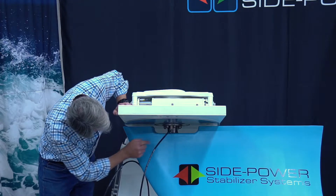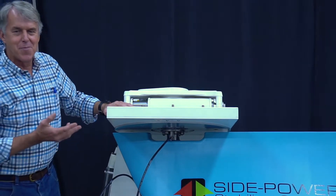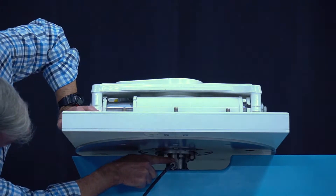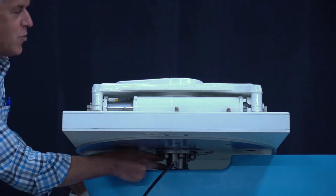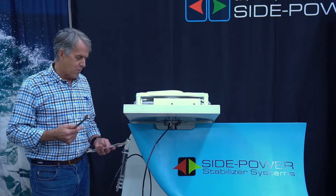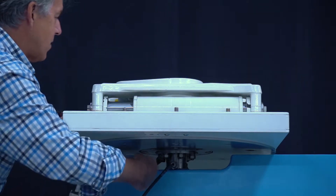If you can see these, there are about a dozen nuts threaded onto studs which are embedded in the actuator. I've taken some of the studs out of this boat show display, which makes it easier to explain and see things a little bit better. So what I want to do is remove all but two of the nuts. I have at the ready some 19-millimeter wrenches — three-quarters inch is very, very close to 19 mil, so that works as well. The first thing I'm going to do is back off all of my nuts and actually remove all of them except for two.